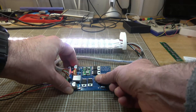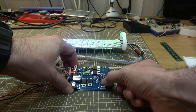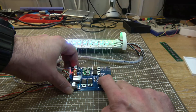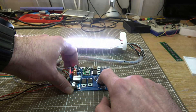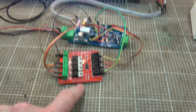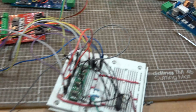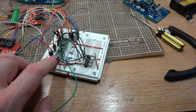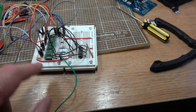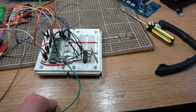I've noticed that the behaviour on this board seems not quite the same as on the breadboard circuit - when I first connect the power without feeding any signal in, all these MOSFETs appear to be switched full on, whereas with the breadboard setup they were switched off. I suspect this may need to change from an inverter to a non-inverting buffer, so I've ordered a bunch of those. The problem isn't how I was driving those MOSFETs because with the MOSFET board in it's doing exactly the same thing. I'm really struggling to work out what other differences there are - same IC, just a different package, same chips, possibly slightly different resistor values.